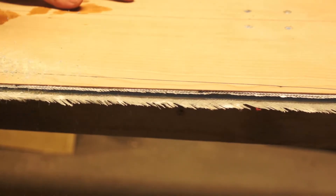The next thing to do is rough cut it using a jigsaw. I've also got a composite bit which, while it doesn't cut wood by itself very well, makes relatively quick work of fiberglass and plastic and won't dull out as fast. It's always good to use the right tool for the job — if you're doing composite work like this, a composite blade goes a long way.